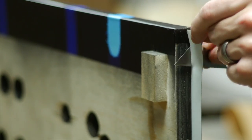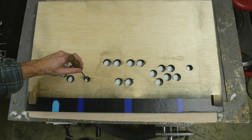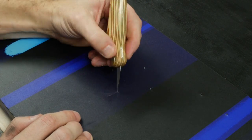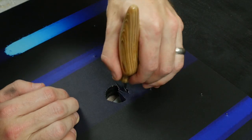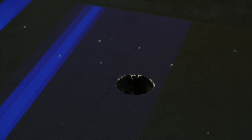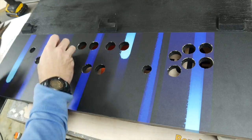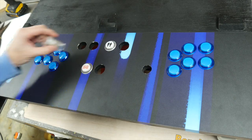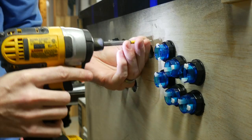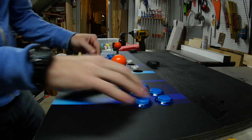For the excess polycarbonate on the top panel, I wanted it to be cut as close as possible so I used a blade right along the edge. To cut out the holes for the controls, I flipped the board over and poked a little hole in the middle of each area. Then when I flipped the board back over I knew where to cut out. From this center point I used a sharp knife to cut out each one of the circles around where the button went. I started out with a pie shape and it ended up being quite a bit of work. I tested the buttons, made sure they fit, and then cut all the rest out. For the rest of them I started at the center, went to the edge and then around the edge — much faster, much easier. I fit all the buttons into their right place and then screwed on the nut for each one on the back. I put the joysticks in place, centered them within the hole, traced the outline on the underside, started pilot holes, and screwed in each joystick. Each one gets a cover to cover the hole in the board and then I just screwed on the ball to the top.